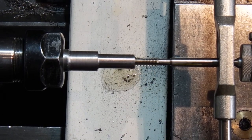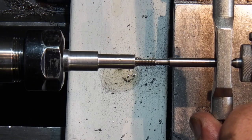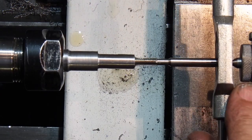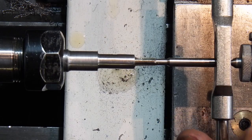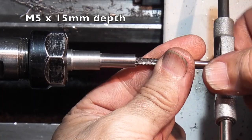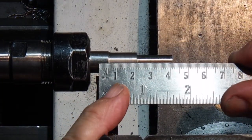My tap guide, 5mm tap and a tap wrench, and I'm using the nut on the draw bar to turn the headstock around. You can see as I turn the tap in, this end is spring loaded and it's in the centre of the tap so it comes out. All I have to do to increase the tension is wind the tailstock in. I've just pulled it out in the collet a little bit so I can part it off to 20mm from the face that I've just machined to the edge.